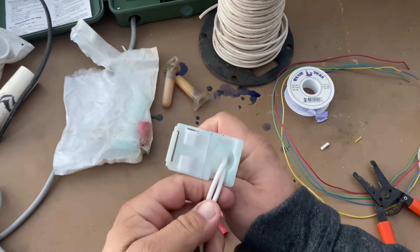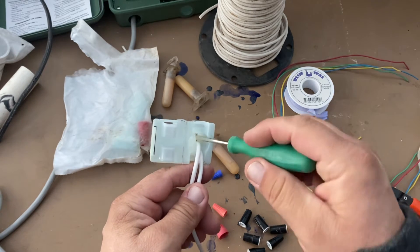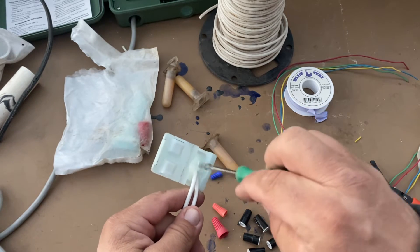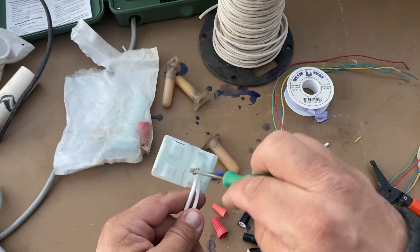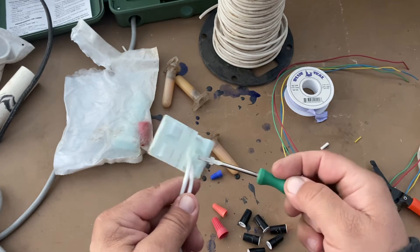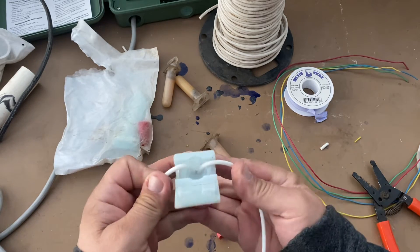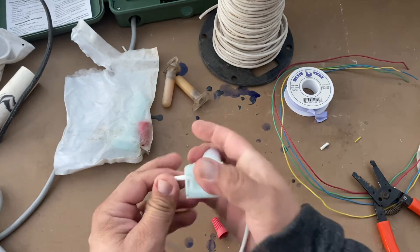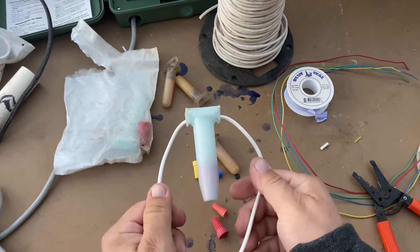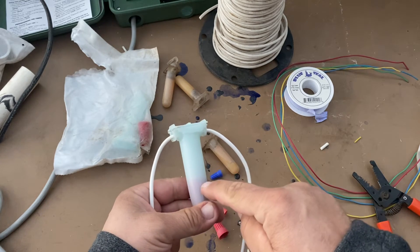You can see there's grease right there. You want to always inspect it — right here you can see all that grease that came out. You can take something and force it down around it if it looks like there was an air pocket; you want to make sure it didn't cause an air pocket. It's not supposed to, but I've seen it happen. Then you pull the wires out to either side and snap it closed — now that is completely waterproof. If it ends up inside a sprinkler box that fills up with water, these connections are not going to go bad.